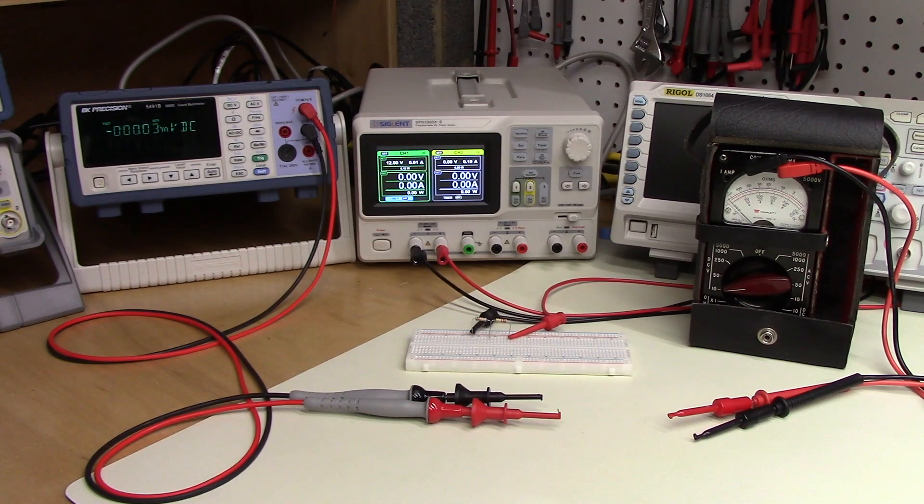When analog meters are employed to make a DC measurement, a pointer or vane is deflected over a scale. The degree of deflection depends on a current flowing through the meter's coil, which is mounted in a magnetic field from a permanent magnet in the meter assembly. When a circuit is probed across a potential difference, a current flows through the probe leads and the meter coil, which produces another magnetic field. The interaction between the meter field and the field due to the permanent magnet causes the coil to turn about a pivot, deflecting the vane so a voltage is read off a calibrated scale. This is known as D'Arsonval movement.